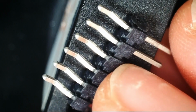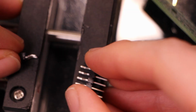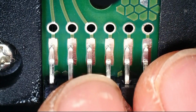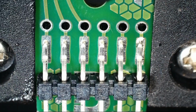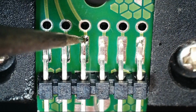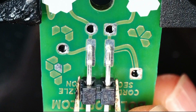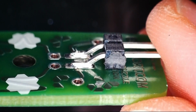We have one power connector and one data connector. Both of them are these surface mount style headers. I'm assuming that we're just going to pick one of these boards kind of arbitrarily to have the connectors on it, and then the signal gets passed through to the other board. Ah, that's a very satisfying flow. So I guess on one of these, the text will be kind of covered up by the connector, and on the other one it won't be. So maybe that influences which one goes on top.